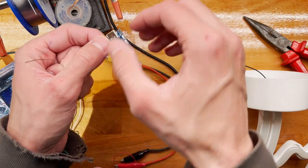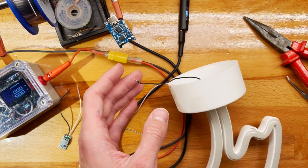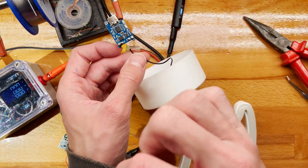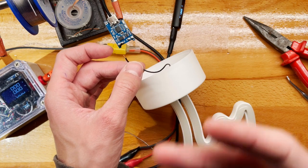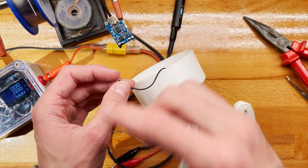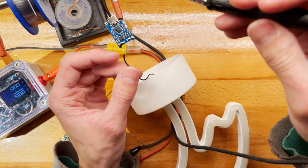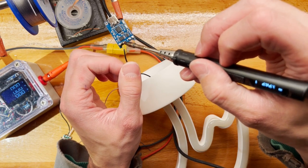And why is the focus not working? Anyway. And so what they do is constantly, right, once every 500 milliseconds or something, they disconnect power to the battery and they measure the voltage of the cell. And they allow for constant current, constant voltage charging. So once they reach 4.2 volts, I think they're set to 4.25 or something, they will start limiting the current, and then at some point they will light the blue LED indicating that charge is done. And what these also have is a DW01, which is this chip here, and that is a charge protection chip.